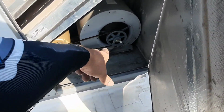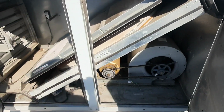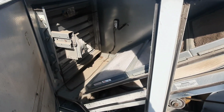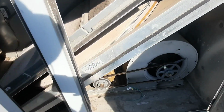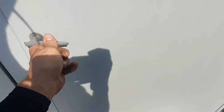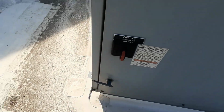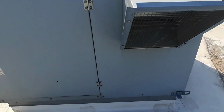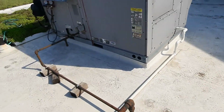So I'm looking at the ERV now. That's not running. This ERV is gonna be tied into that, and I wonder if that's why it's drawing so much. This is supposed to be feeding it some fresh air. We could always crack the economizer, because the economizer's closed. I don't know exactly what's wrong with this, but I got no outside air damper right now. Like I said, it was turned off. The wheel's not running. That's gonna need some further diagnosis. Still waiting for that guy to time out. I did hear some kind of actuator opening. I'll just let them know what they've got. This is down. If they want us to look at it, we can. Unless it's causing me too many problems here, I'm not going to be terribly concerned about it. It's been off for a while.